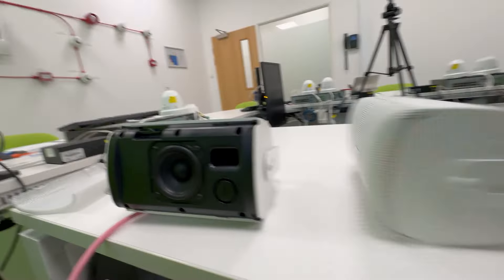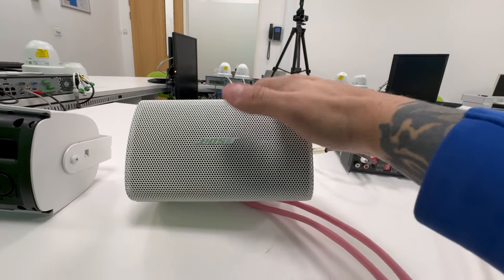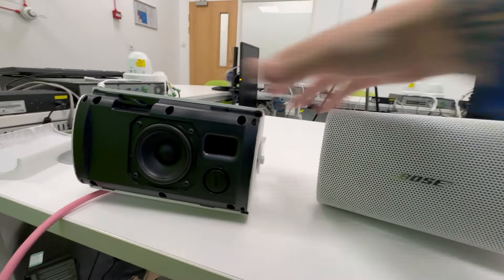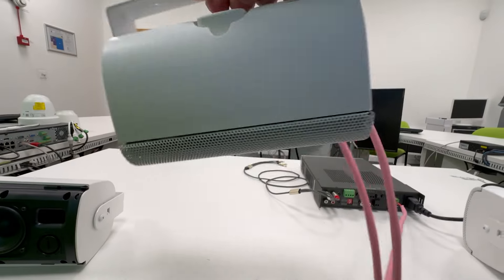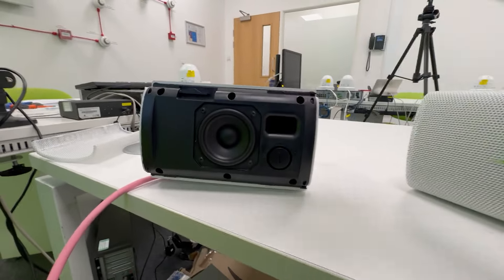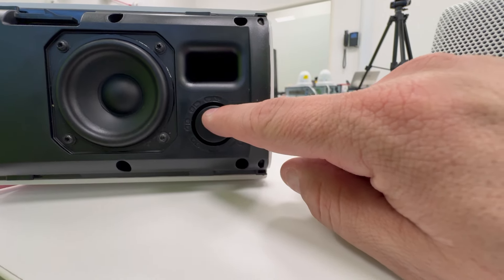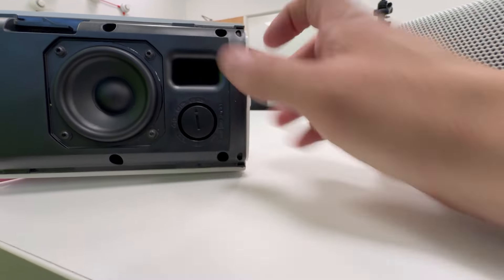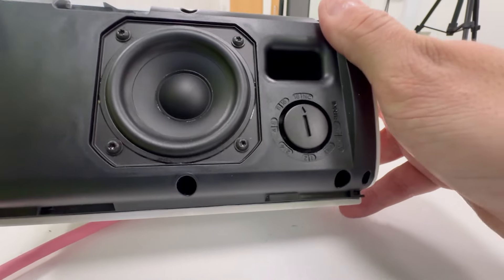From this speaker cable — a four-core cable — we go out from the amp and the speakers are wired all in series: in and out to the first speaker, in and out to the next, and so on, with the last one on the line. This is a 100 volt line setup. I've left the grill off one speaker so you can see the paintable white grill with the Bose logo. The bracket can be tightened and adjusted to fit the speaker wall-mounted in multiple orientations. You can adjust the wattage tap, which is set to 100 volt line at 16 watts by default.